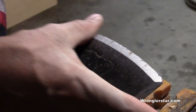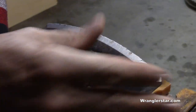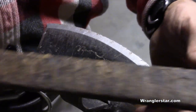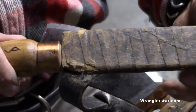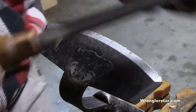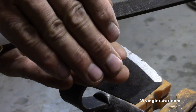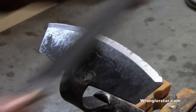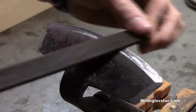Now is the time to sharpen our tools. This is something most people don't do anymore. It takes so much more effort to use a hoe or shovel that's dull with rounded edges — the work is hard enough without making it harder. With just a little time and a good file we can remedy that. Make sure when you buy good files you put them in a cover — granddad used masking tape — so they don't clatter around and get dulled. For digging tools, we always do a chisel grind: flat like a chisel, filing on one side only. A 10-inch mill bastard file is best.